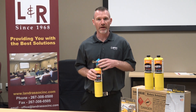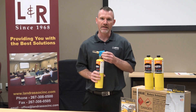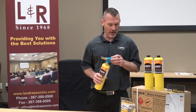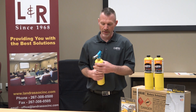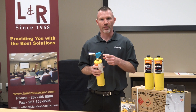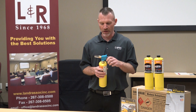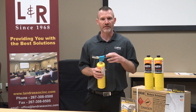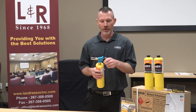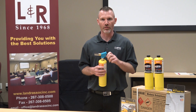So we'll jump right into it. This is our HB875B torch tip. This is a swirl-type tip under our Expert series. It has a self-igniter on it, and then a thumb screw in the back for your fuel volume control. Once I light this tip, it's going to stay lit until I either blow it out or relieve the gas pressure by shutting the thumb screw in the back — the throttle.